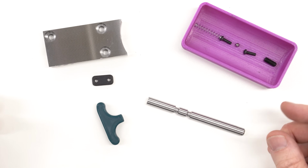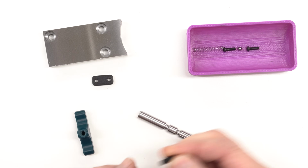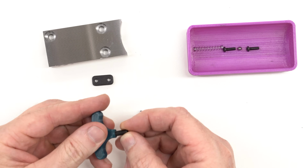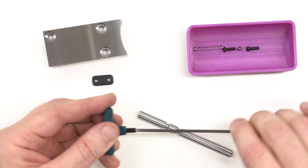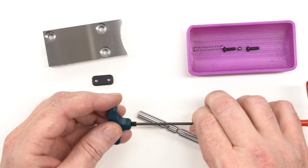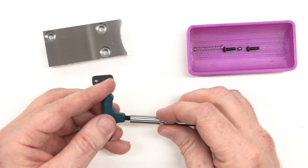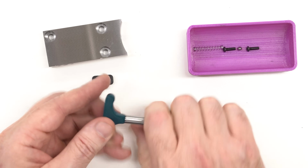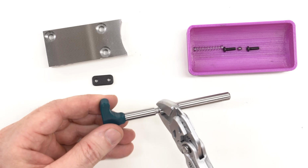With all the parts made, we can assemble this. Start by putting the handle on the end of the pin, and I'm just using an M5 set screw here. I had planned on using a longer screw than this, but when I went and looked in my drawer, this is the longest one that I have. I really wanted to get 10, maybe 12 millimeters of thread inside the plastic handle just so that they'll hold better because it's a soft material, but this is all I had, and it'll work. Don't worry, it's only temporary, unless it works.